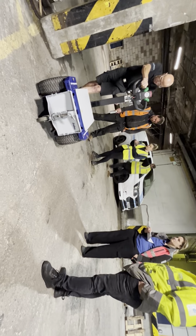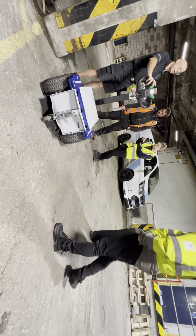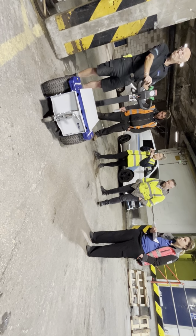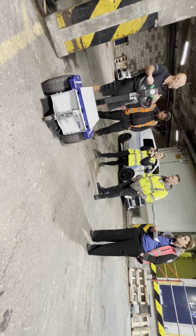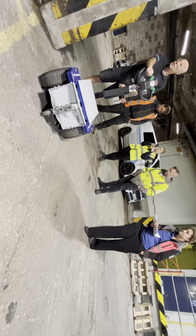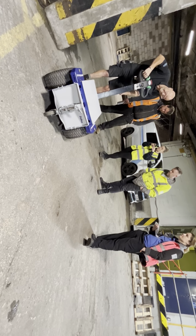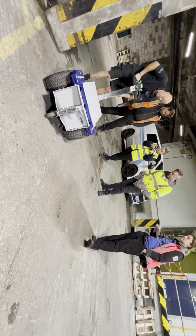As I said to him, it's not going up. It should do. When it's up like that, it will not drive. It disconnects the roller switch down here, which is for your safety. Because if you're using it like that, imagine you're backed into a corner, this thing's coming with you, and it will crush your legs. And it pushes people off over the top of barriers and stuff like that. That should move freely. That should be completely easy to position.